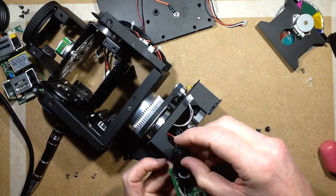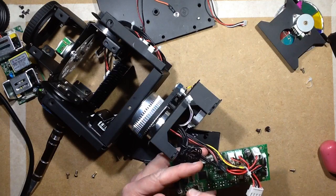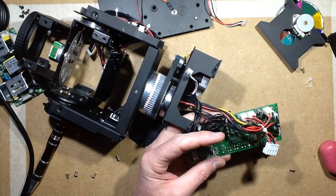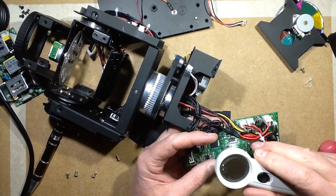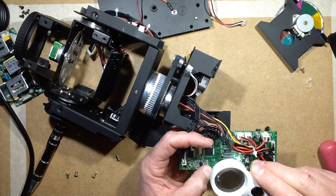I really like some of the features in this. I love the fact that it's a ULN 2803, as I said, driving the stepper motors. That is really quite pleasing. I thought it was going to be something more complicated. I thought it was going to be some fancy wave drive control.